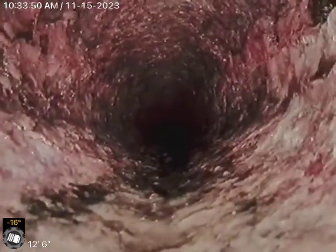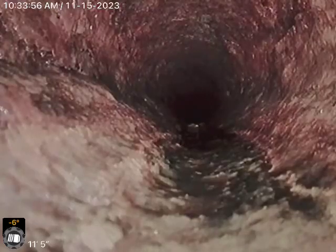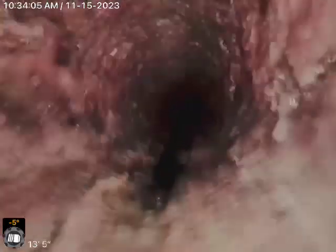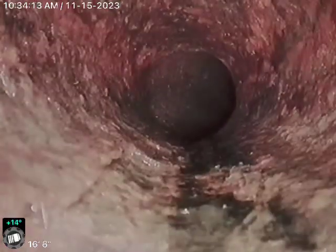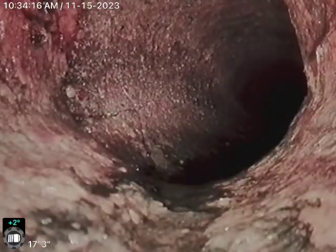Hey Kevin, how's it coming? Oh, we're just scoping everything out. So right at the edge of the foundation, where it transitions from the steel pipe to concrete pipe, the concrete has a crack that I'll need to do something about. It's nothing severe right now, but it could become a major issue sometime in the future. Primarily, the problem was the wipes, huh? There was no other clog that we could detect. Yeah — I asked Alicia while she was awake just a little bit ago, and I was like, he said they found wipes. She was like, apparently three-in-one.